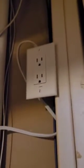So I had an electrician come in, and basically the wire above is leading to the furnace itself, goes over and down, but the wire across goes to the wall and then leads to my power panel. So he removed the furnace switch, and replaced it with kind of a power plug. So the furnace now is running through a power plug. Plugs in here, and if I have power, it's fine there. If there's a power outage, I just unplug that power cable.